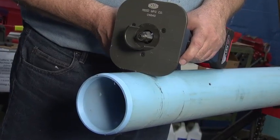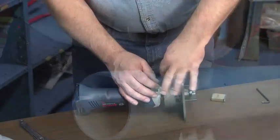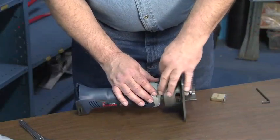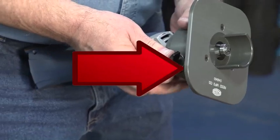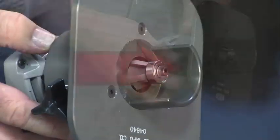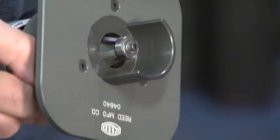This tool is to be used on plastic pipe only. To adjust the depth of the chamfer, loosen the adjusting knob and slide the flange plate up and down until the required amount of router bit is exposed above the plate, then tighten the adjusting knob.